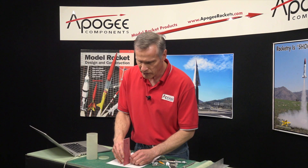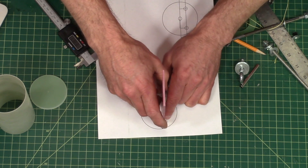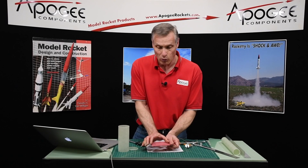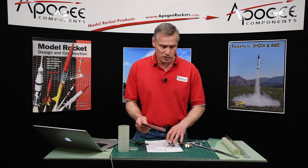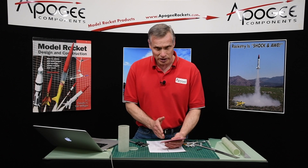Also on the edges, it does interfere just slightly with the inside of the tube. So I'll probably also cut maybe an eighth of an inch off this way and then three-quarters of an inch off this way. It's still plenty of board for my electronics and the battery, so I'm not worried about that — it's going to fit just fine. I just want to know that ahead of time because I want to do all the prep work first before I start assembling. Cutting that straight is going to be a nasty job — you could use a band saw, but fiberglass just makes them really dull. So I'm going to use a regular metal hacksaw to cut that off.